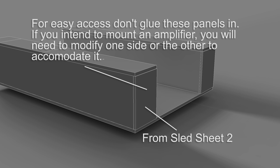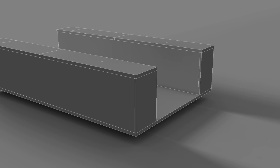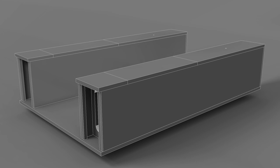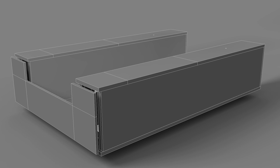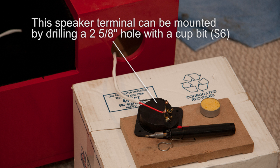Make sure you leave space there because once this thing is painted, the doors don't open and close well. Once you have the fundamental base pods attached, you need to put the actual end caps on which strap everything together. Start in the back and basically screw these on. In my case I finished them, but you may just want to leave those with screws so you can pop them off more easily. If you're going to add the amp, you need to cut a hole in one of these to hold whatever electronics or amp components you want to put in. This back plate needs to be a one-piece unit because it's essentially what's strapping the two sides together. You should also pre-drill any holes for surround sound hookups at this stage and complete your wiring.